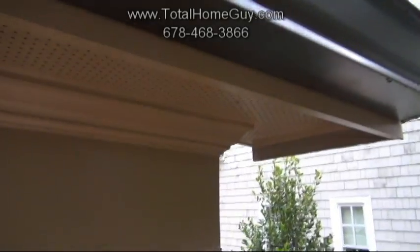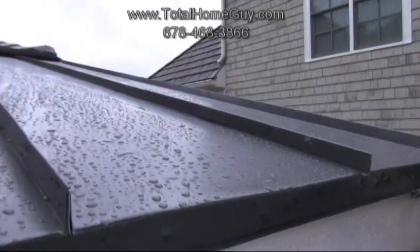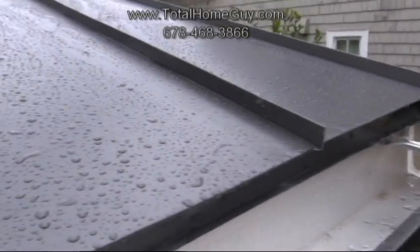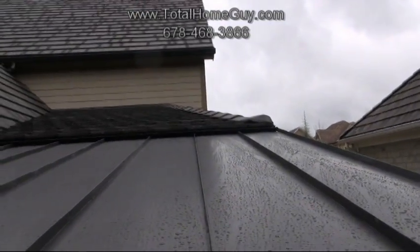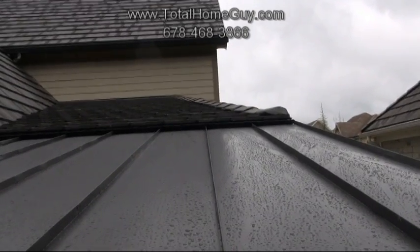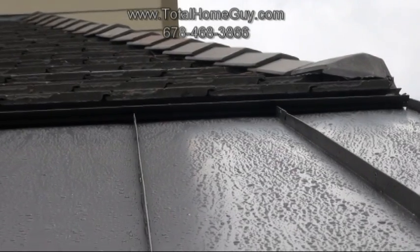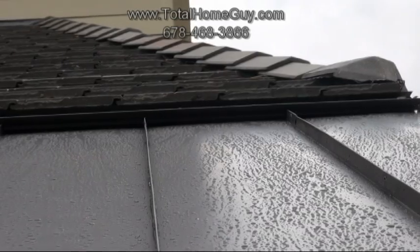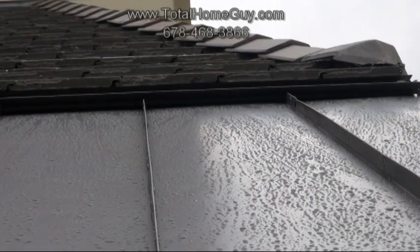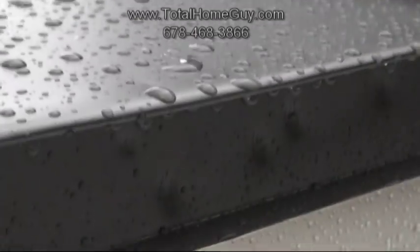Getting below the roof sheathing surface. When we get to the top, we see we've got a nice brand new metal roof. I don't see any problems with the roof itself, but it does come in contact with a fairly unique and complex cement tile roof. It looks like we have some problems with the flashing at the connecting point. So I think if we get the actual flashing corrected between the two roofs, we can stop that water from running all the way down the top of this roof surface underneath the metal and keep it from running inside the soffit.